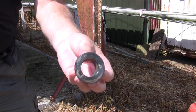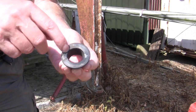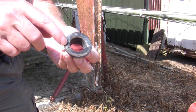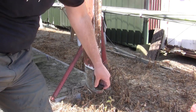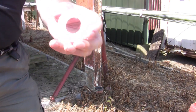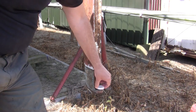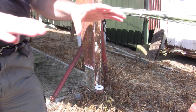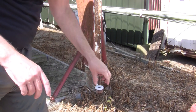Now the trouble with this one — I don't know if you can see that — is there are great big lumps cut out of it. I'm guessing that some grit or something got in there, then it turned and got stuck, or a barnacle, something like that. So what I'm going to do is reassemble the rudder. I've made an HDPE washer — I know that HDPE does not stick to epoxy — so I'm going to assemble the rudder, put a layer of thickened epoxy in there, let it settle, and then I shall have a lovely flat surface at the bottom of the rudder. I shall do something similar at the top, but that's not quite so critical.